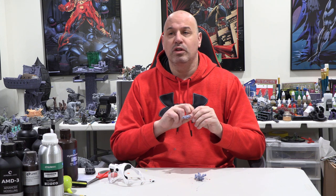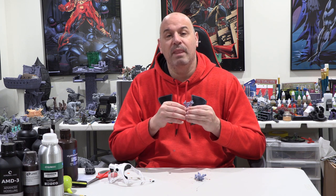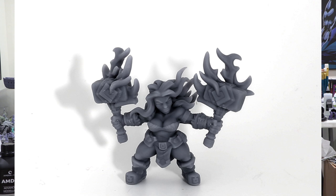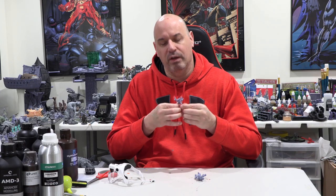For some reason — maybe it's chemistry, we'd have to ask Goober Town and talk to Brent — it does seem like for the few years I've been doing this, any resin that is tough, slash flexible, slash durable, the trade-off is it's not quite as detailed in the printing as the more brittle resins. One day someone will hopefully concoct a formula that prints with the highest resolution and is also extremely durable, but so far that hasn't happened in my experience. There is a trade-off between durability and how fine a detail can print.